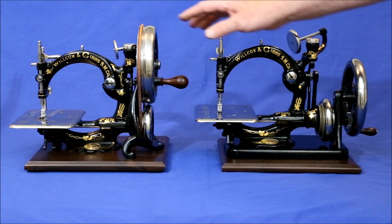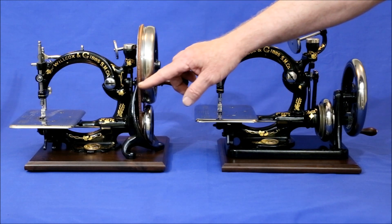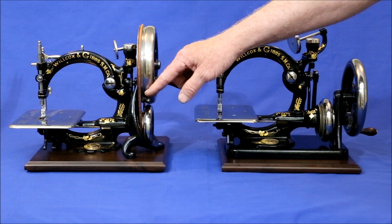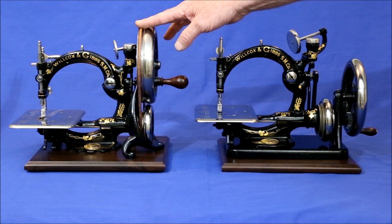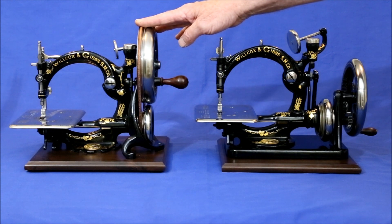The British style uses a belt drive which is extremely smooth and quiet, but requires a base to hold the machine and crank together. The belt stretches over time requiring periodic shortening, and the height of the design does give the machine a taller appearance.